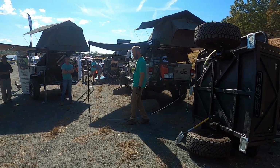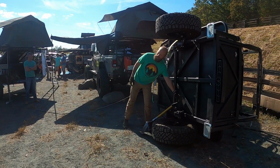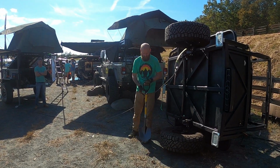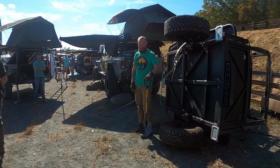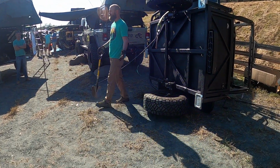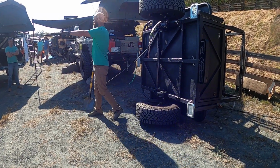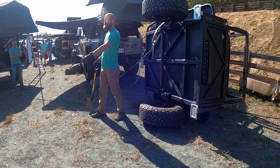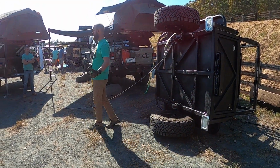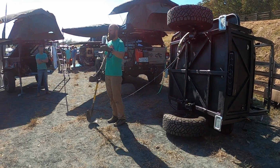If you have the chance that you might drag a trailer, again, your trusty recovery shovel, your crazy beaver shovel here, what you can do is take a notch out of the ground right where the tires are going to start to grab. So when the tire slips into that notch, it's going to pivot that trailer over, right? Doesn't have to be extreme, but for each tire that's on the ground there, we do need to cut that notch out, and it'll help to get it up and over if we need that twisting motion.